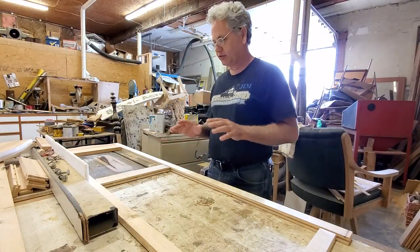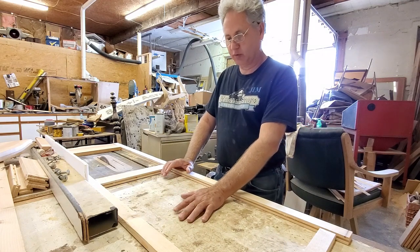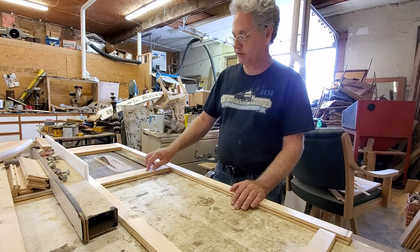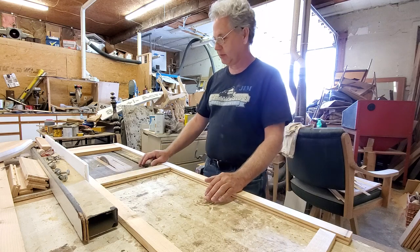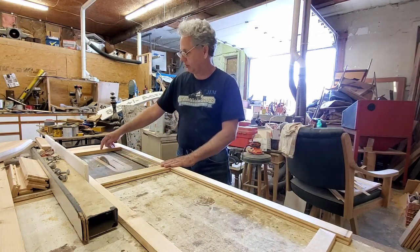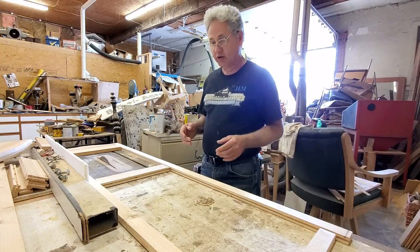I've done a dry fitting on our project. These are our dressing screen panels. In the lower half we're going to put a quarter-inch piece of plywood — that's what the mortises were for. We also need to put mortises in the center piece, so if you haven't done that, back up and do that. As the day has gone on, my wife has called and changed the design — she now wants an acrylic panel in the top section, which means I have to go back and put a mortise in the top piece too. The design is changing throughout the day but we're still moving in the right direction.